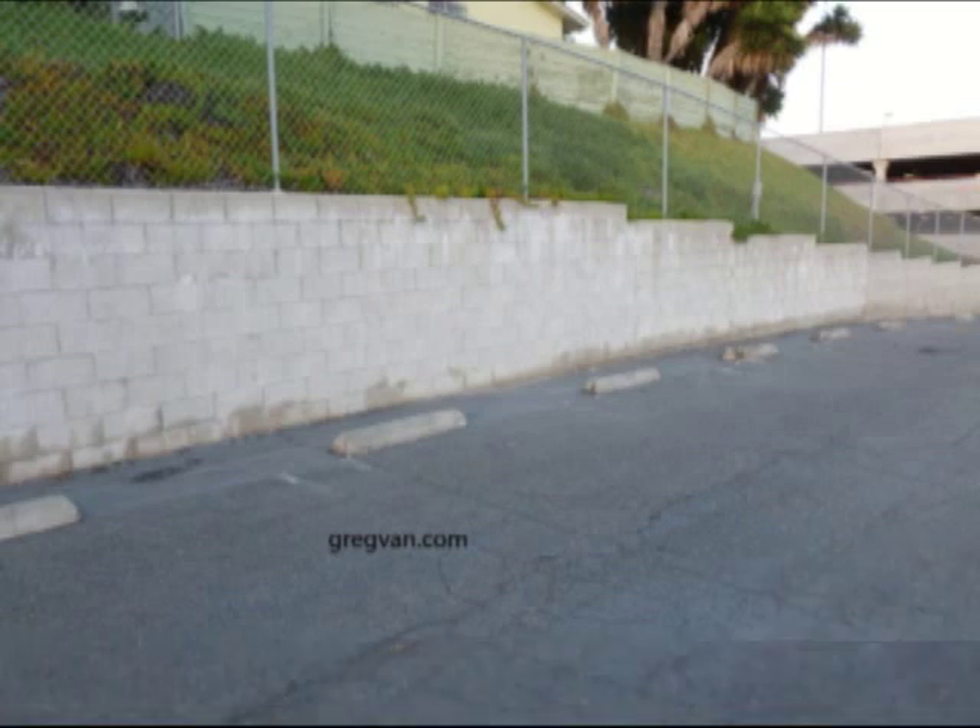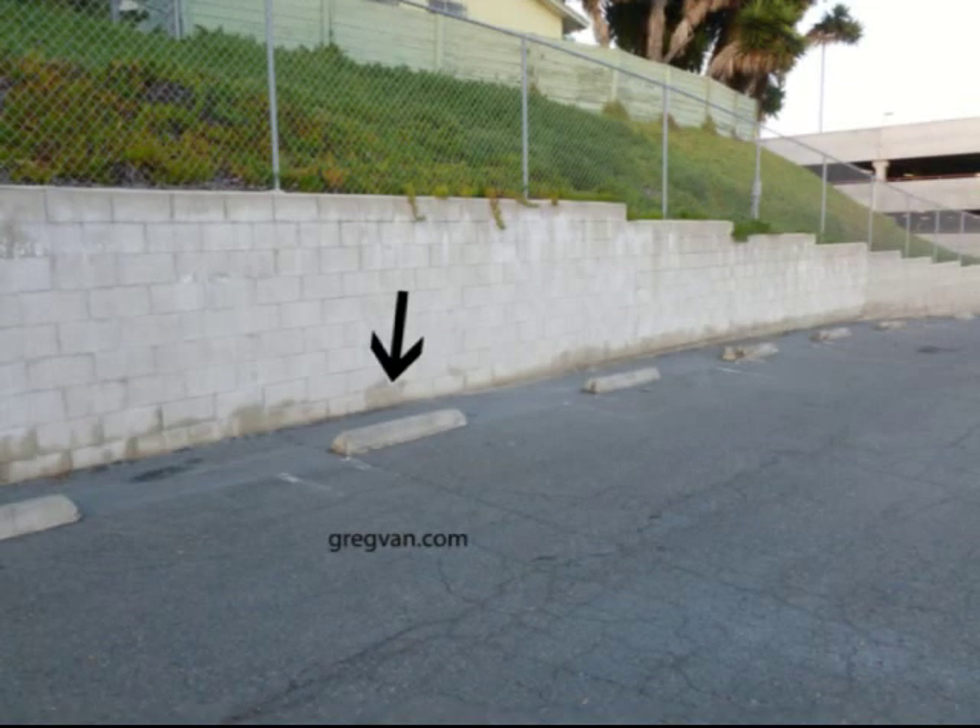Here's a view of the rest of the retaining wall, and you can see there's no tree, no plants hanging over it — but there is still moisture. You can see the little gray spot coming through. This tells me the ground cover is there for a reason: it's there to prevent soil erosion. If the ground cover wasn't there, whenever it rained, all of the dirt would eventually wash over the top of the retaining wall and create a problem on the other side.